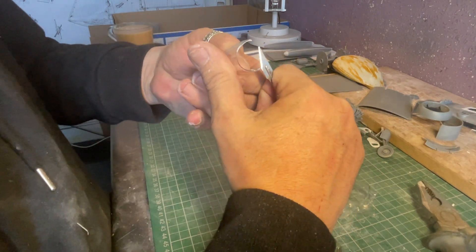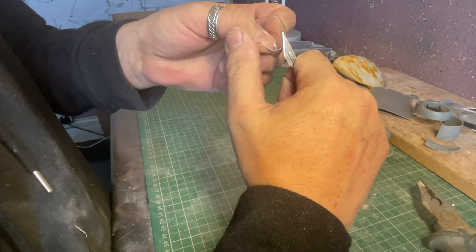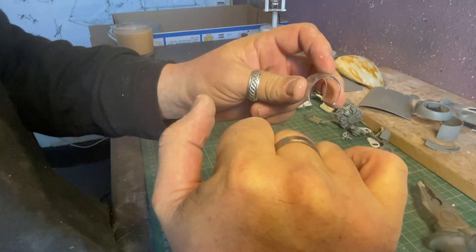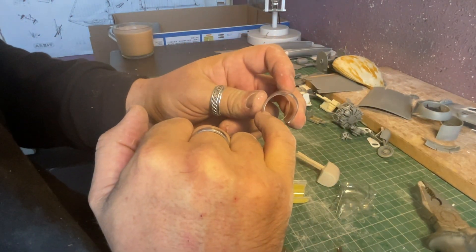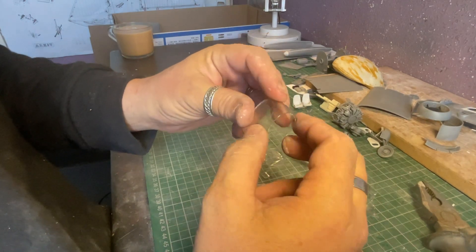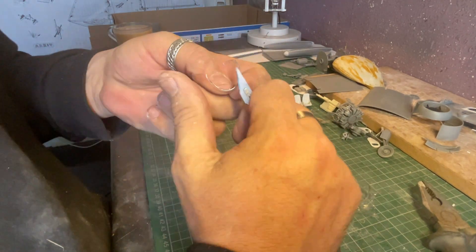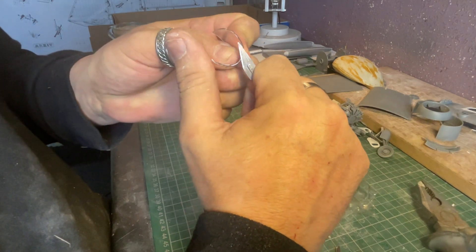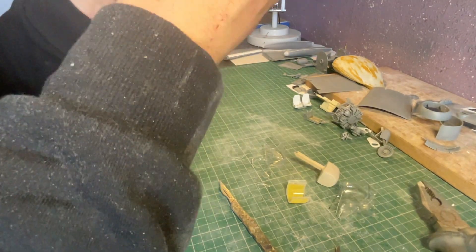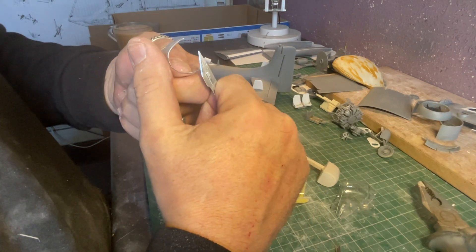There is a little bit of a learning curve. One of the things with the learning curve is making sure you don't over-attenuate the plastic — don't stretch it too far. If you look at this, you can see it retains a one-mil thickness all the way around. If you pull too hard it'll be one mil up here but the ends could skin down to about half a mil, leaving you with a canopy that's too floppy. As you can see, this is a nice thick canopy for its size — it retains some strength in its form.